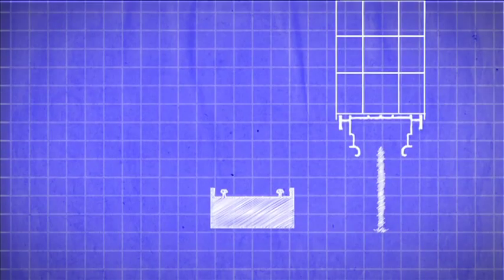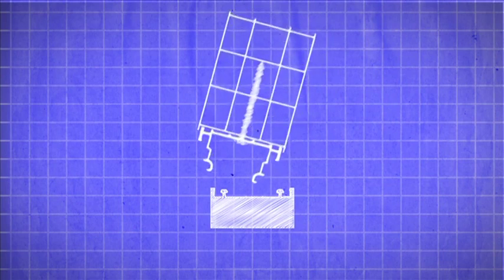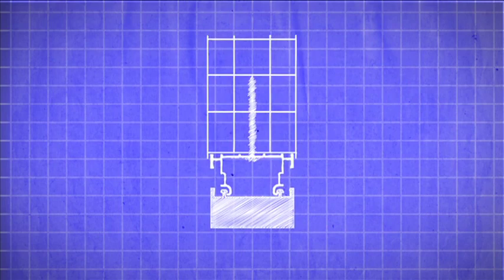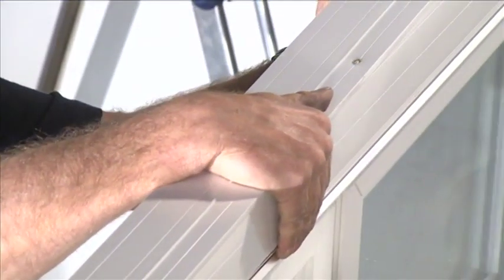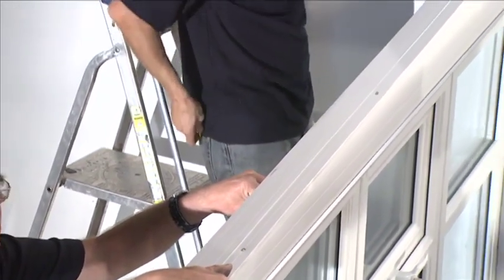The furring adapter will be pre-fitted to the bottom of the furring. To fit the furring, lift into place. Locate the connector hook with an inner window leg and rotate, pushing firmly to engage the inner legs of the window with the legs of the connector. Ensure the location legs interlock with the windows and butt up against the eaves beam and wall.